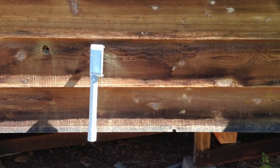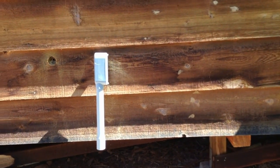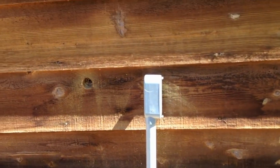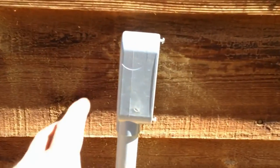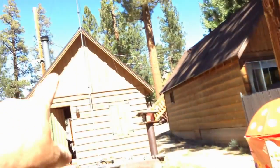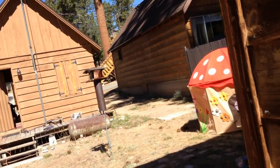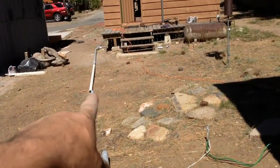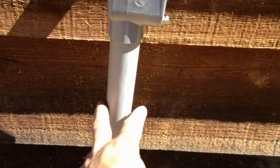Quick overview of the conduit run — it's a little more involved than I wanted it to be, but it's the way it worked out. Coming out of here is just going to be pre-wiring DC for the top of the cabin. I think I'm going to have to add more panels, so they're going to be fed down this conduit run. Coming out of here will be that DC MC4 cable plus my four trimetric sensing wires.